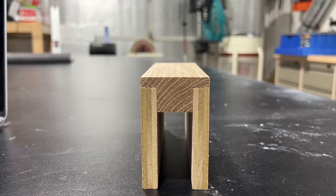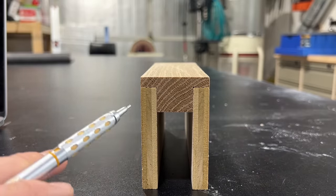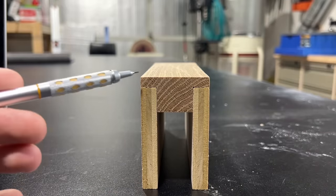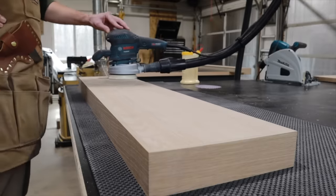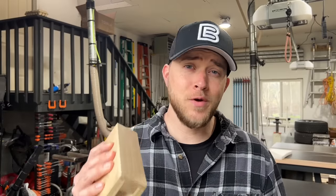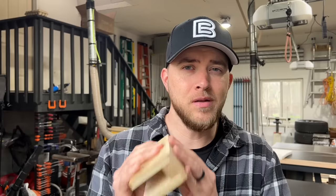So I set out to find another way, and this is what I came up with. Instead of the entire shelf being made out of plywood, I chose a hybrid approach and made the face of the shelf out of real hardwood. I then add a rabbet to each side of the face that can accept the top and bottom panels of the shelf. This leaves a quarter inch of real hardwood on each corner, which is obviously much stronger than plywood veneer. I do have a video all about this technique on my channel. And while this technique does work really well — I've built many shelves this way — I always knew I wanted to try and do it a little bit better.